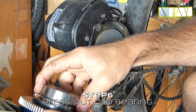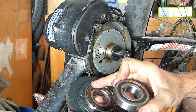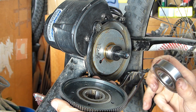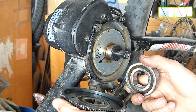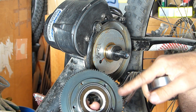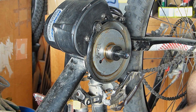The trick is to get this bearing in there. I'm going to take it over to my brother and try to press it out with a huge press. We can also heat this up and try to hit it out with a hammer. You can freeze the bearing using a can of air spray — if you hold the can upside down you can use it to freeze the bearing — then heat the outside with a heat gun and try to pop it out. But I'm going to try to use a press.